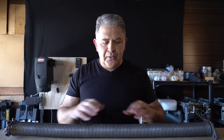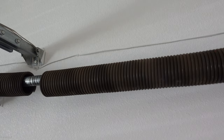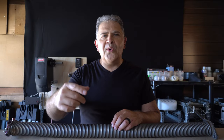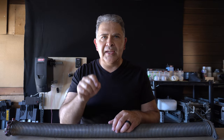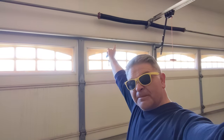If you know you have a thick gauge spring — that is a 250 wire, or perhaps a 262 or a 243 — don't go with a lesser cycle or a smaller, thinner gauge spring. Go with the same type of spring or with a spring gauge just above what you initially have.